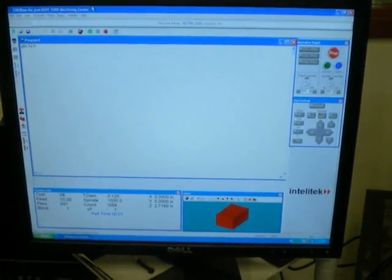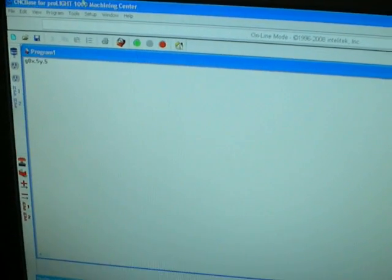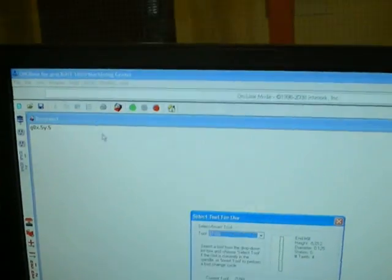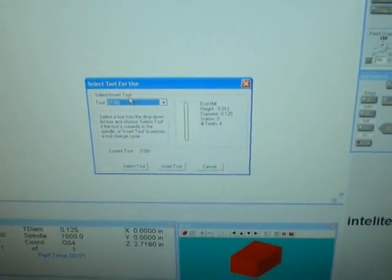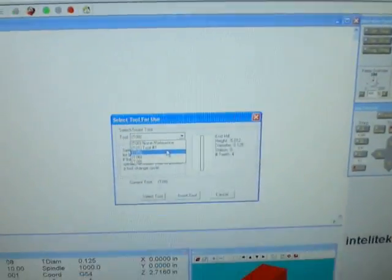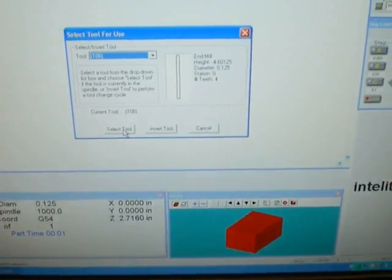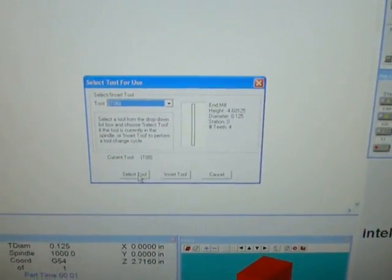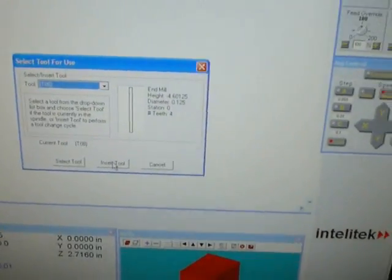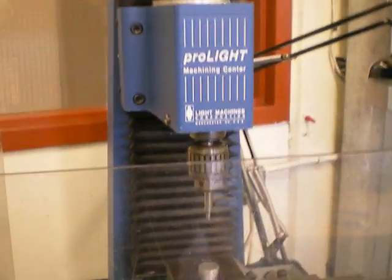What I want to do now is change the tool that it thinks is in the spindle, as well as change the tool. I'm going to come up to the Tools menu and click 'Select Tool.' This allows me to select the tool I want to use — in this case, tool number six. I then have 'Select Tool' and 'Insert Tool.' Select Tool just tells it that tool six is in the spindle. If I say 'Insert Tool,' that not only tells it that tool six is in the spindle, but brings the tool changer up to a position so I can actually change that tool. Now the machine moves up to max Z, and then I get to change my tool.